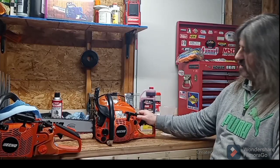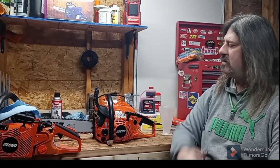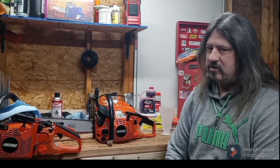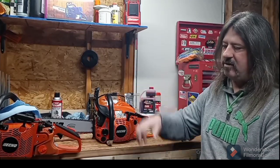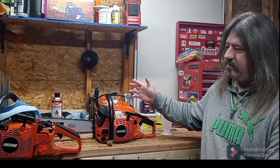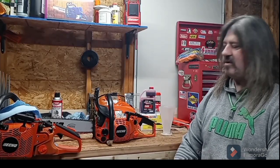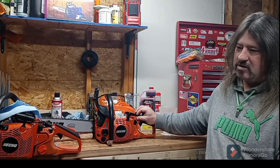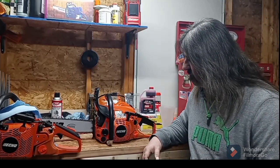Simple on and off switch instead of everything trying to be complicated into one. Maybe you only want to high idle start your saw. You just turn the switch on, pull the choke out, push it back in, you're on high idle. I mean, it's really simple. You flip the choke, high idle's off. It's pretty simple, man. There's not much that can go wrong with this metal switch versus a lot of the plastic ones they have on saws nowadays.